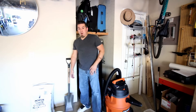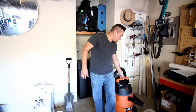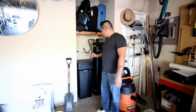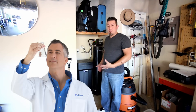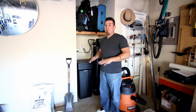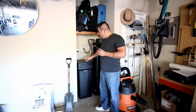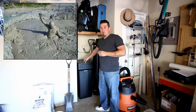I'm going to walk you through doing some basic maintenance on a water softener system. You can actually get some of these serviced through a technician if you want, but what I'm going to show you is a little more low-level basic stuff that you should be able to do yourself. Number one, I'm going to show you how to take the sediment out of your brine well.